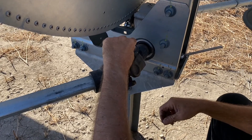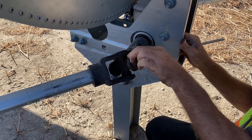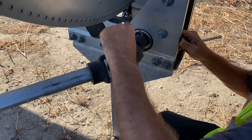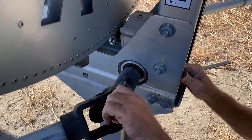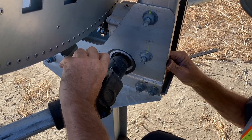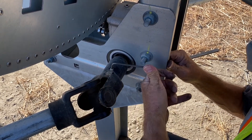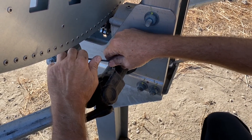When it's sticking out 6.13 millimeters it's not in the slot. It can run that way but eventually it's going to loosen up and fall off. So around 6.1 millimeters is what you'll see if it's going down on the end of the shaft rather than in the notch.